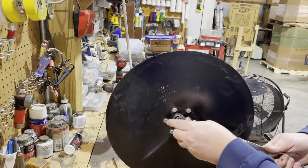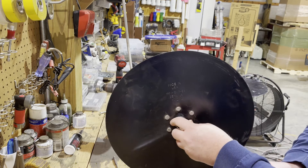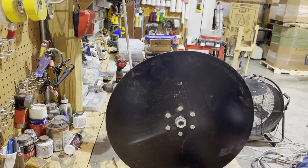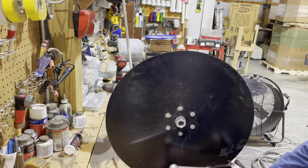Our technician is going to place the disc onto our pre-machined shaft, so it's got a tight seal against the bearing — no wobble horizontally side to side. We're going to tighten that nut down to about 85 to 90 foot pounds, just as we would on a planter.